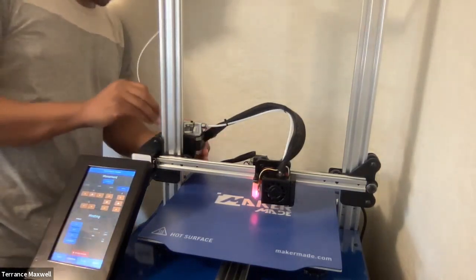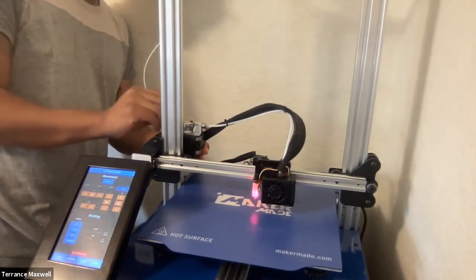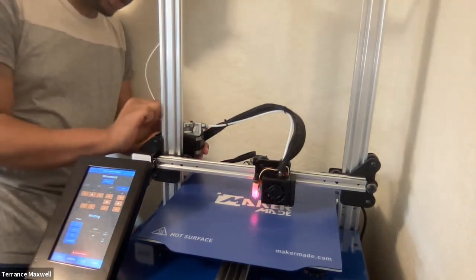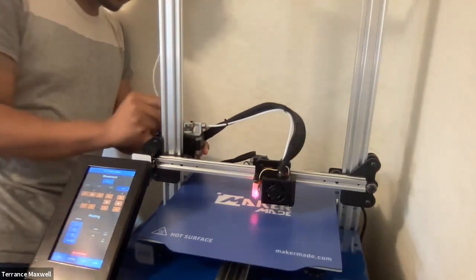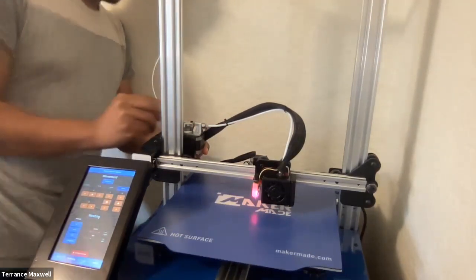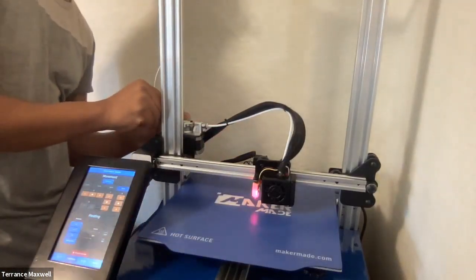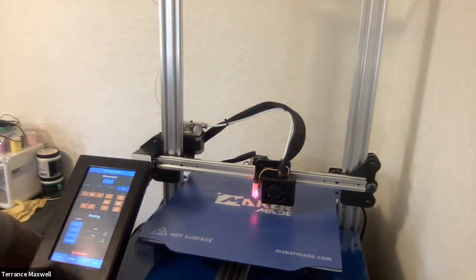Basically. Gotcha. Yeah, because it looked like you might have been holding that open while it was spinning, and then the gears won't engage. Okay, understood. Let me try this again. So initially open it up, select the filament. I'm gonna hit forward on E, close the gears. Do you feel it pulling in now? Yep. Awesome. Yeah, so let's do that several times, and then that should get it to the end.